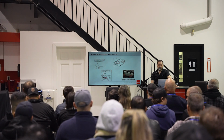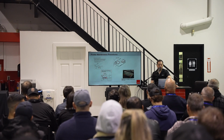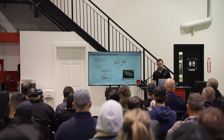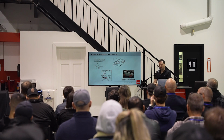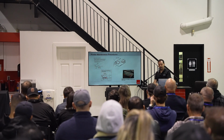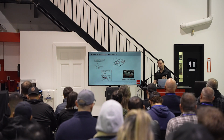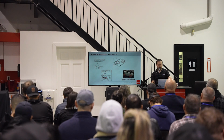Then you've also got your cap rubber. So the printhead, during its automatic purge, will go and sit on these two caps. Underneath the caps, there is some pumps that draw the ink out. And if those caps are not cleaned, essentially what's happening is ink's going back onto the printhead or not creating a good seal, right? So when it's trying to purge, not enough ink will be pulling through, and you'll have a lot of the nozzle drop out.